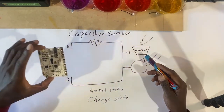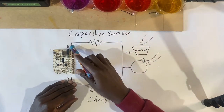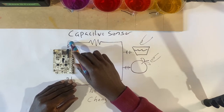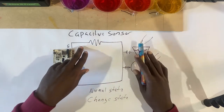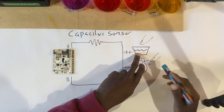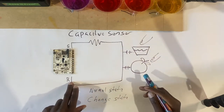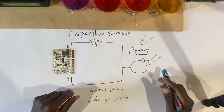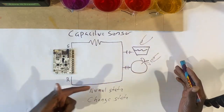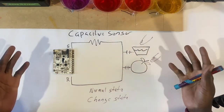We hook it up to a board like this — the Bare Conductive board. That board basically sends a signal to itself through a circuit at about five volts. It goes through a resistor and then all the way over to the cups of water or fruits and vegetables. It comes back to the receive end of the board, and the board registers how long it took for the five volts to travel around.